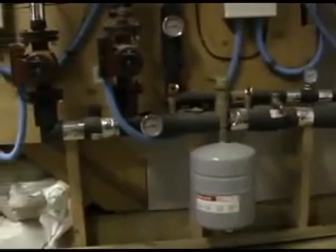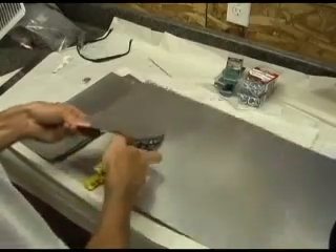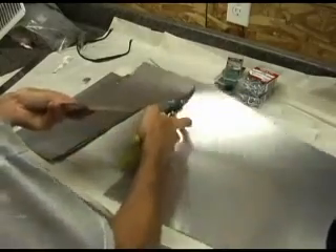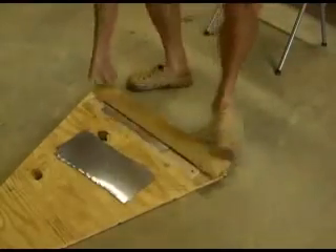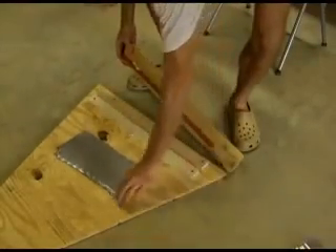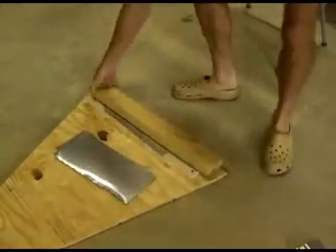The radiant floor system is composed of a pump and a thousand feet of PEX tubing stapled up using aluminum heat distribution panels. There are better distribution panels on the market, but you can make these yourself using aluminum flashing. Finish this by placing a layer of insulation a couple inches below the PEX tubing so you drive the heat up through the floor.